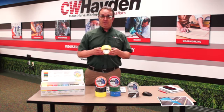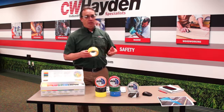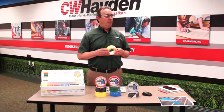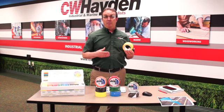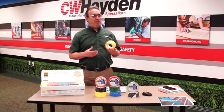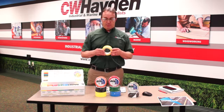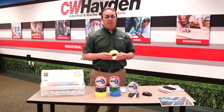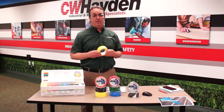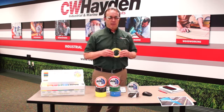One very unique characteristic of the 3M 971 lane marking tape is that it has a unique polylactic acid backing. The key ingredient for the 971 adhesive system is an environmentally conscious plant-based material versus the traditional petroleum-based products used in making vinyl tapes. So it's very thick. This backing provides top-tier durability and you use less fossil fuel. I know a lot of facilities are very conscious of products that use less fossil fuels, which is a great benefit, and this is one of those.